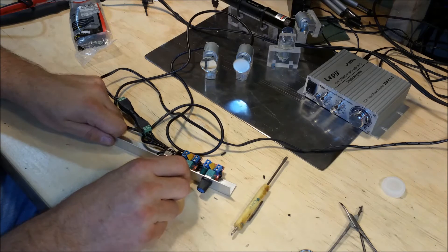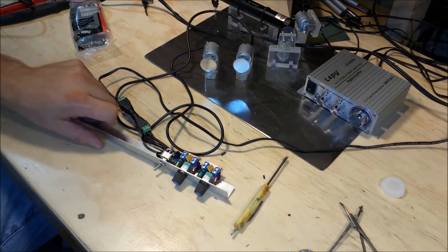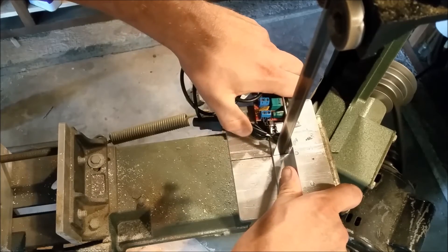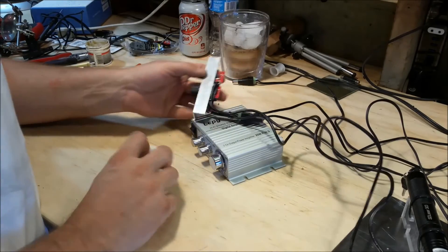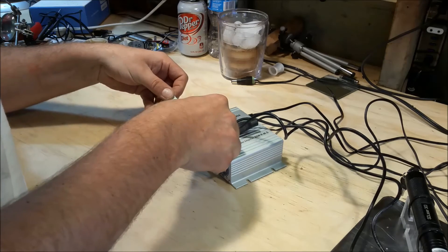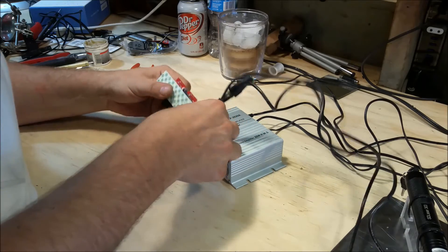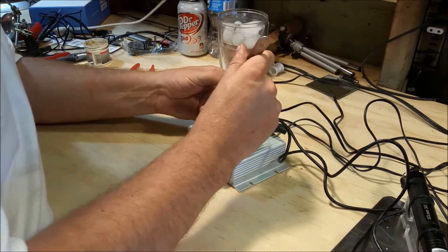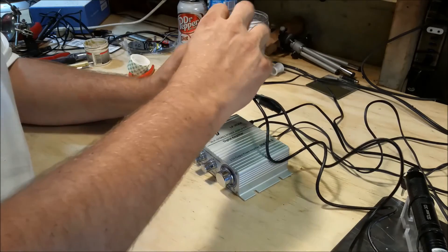You can tilt the mirrors — this is an awesome, outstanding optics bench. I have not seen anything like this anywhere and I'm really happy with it. I'm going to cut that aluminum angle to the right size to match the top of the amplifier. The amplifier drives the linear motors — there are two linears, one vertical and one horizontal. The amplifier is plugged into the stereo and drives them with either music or oscillation. I'm attaching this with 3M double-sided sticky tape right on top of the amplifier to get it all collapsed down.